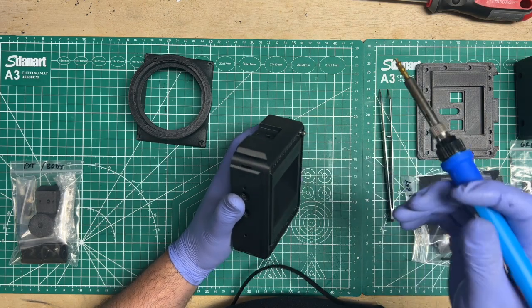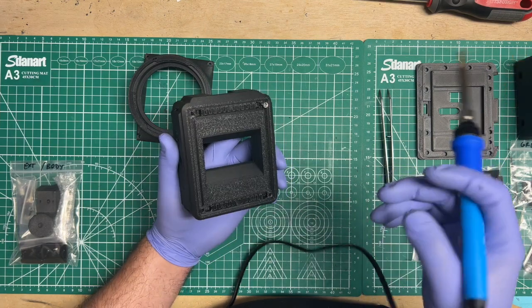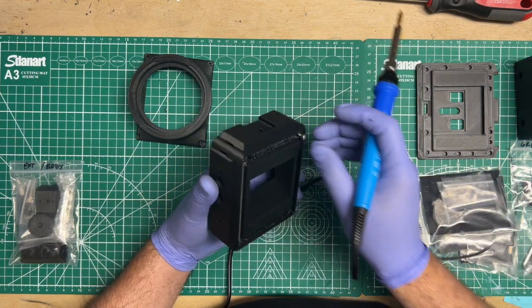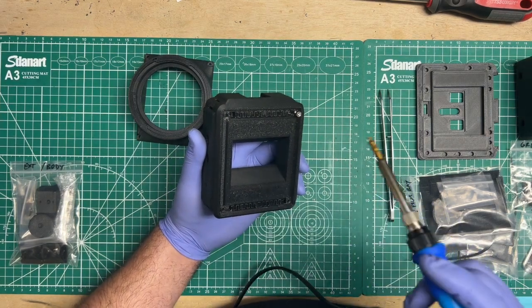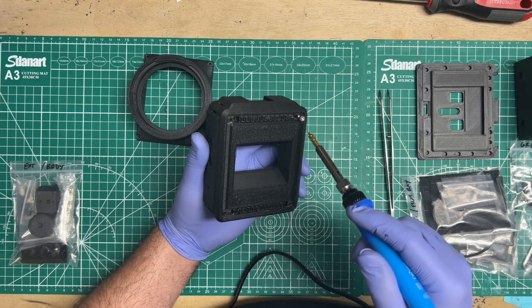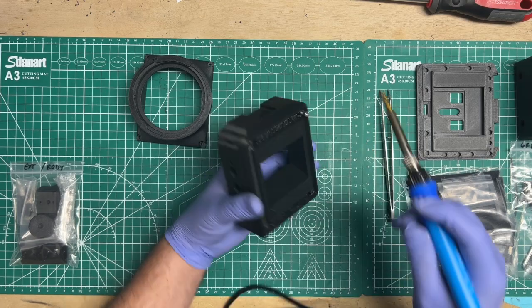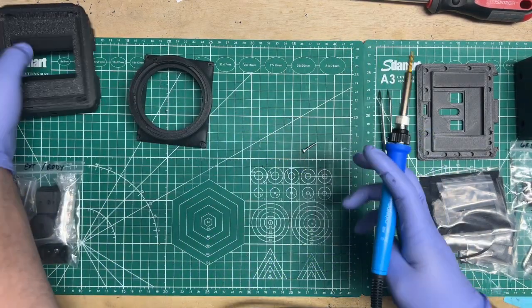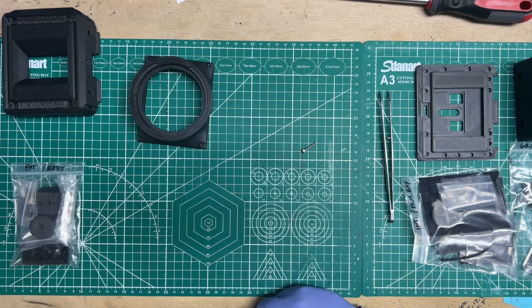So essentially you seat the nut into the plastic. It's kind of like putting in inserts, really. And then I would try loosening it to get that screw out of there, because maybe you messed up the screw, and try a different one. But if you're brave, then try to tighten it from there and hopefully it'll do its thing. So that's a pro tip there for recovering from those situations.